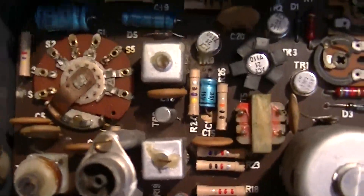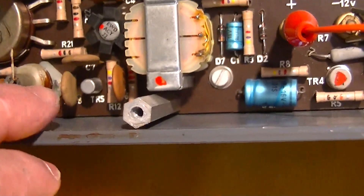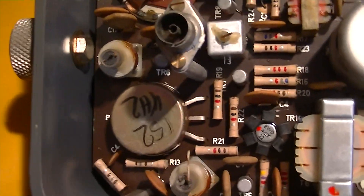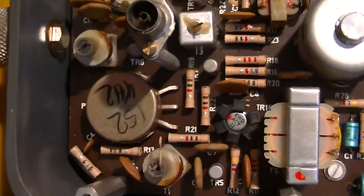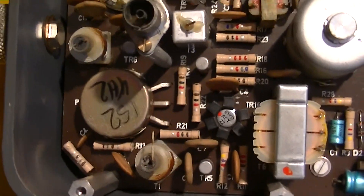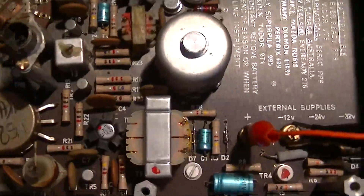Here's the depth range switch — a nice little silver-plated switch. Here are the two low-frequency coils, T1 and T2. My plan, if this thing works, is to try to tune it to my existing transducer. I need to look at the documents I downloaded — this runs at either 150 kc or 200 kc; I can't remember, but I think it's about 50 kc different from what my Signet instrument works at.